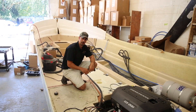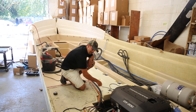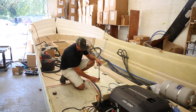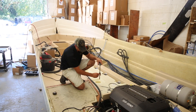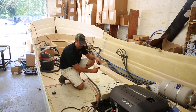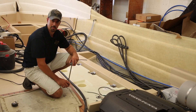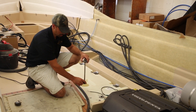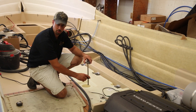We're inside the Ranger Tug factory here in Kent, and you can see we put the sender in the back of the tank so you can access it, and also to show you how this works. The sender sits in here. As the fuel level rises, it goes up and monitors right on the Volvo Penta Display in real time based on where your fuel level sits. So keep in mind that the fuel level will vary depending on the attitude of the boat — as the bow goes up, the fuel travels to the back of the tank and the reading will increase.